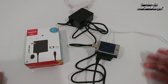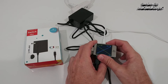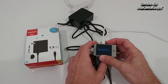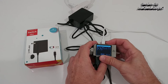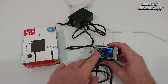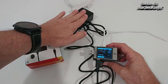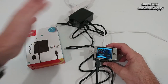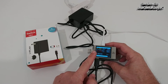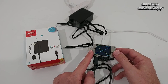We also want to see if we can start it again to confirm it's not damaged from the brief overcurrent. We start it again and it comes back fine. I've repeated this test about four or five times and it always came back with no damage, no special heat or anything. If you're using 39 watts for a longer time it will produce some heat, but the charger consistently stops at around 43 watts.